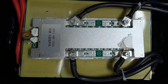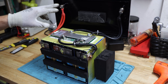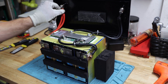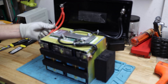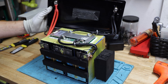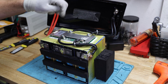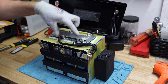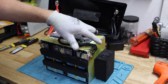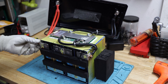Opening it up, here's the BMS. Starting with the most obvious — the terminals are pretty tight, but no torque marks whatsoever. They are hydraulically crimped. We have six-gauge wires — six-gauge on positive and six-gauge on negative — going from the terminal to the BMS. Then from the BMS, using different connectors, routed to the main negative of the cell pack and the positive as well.